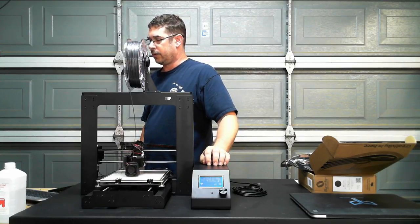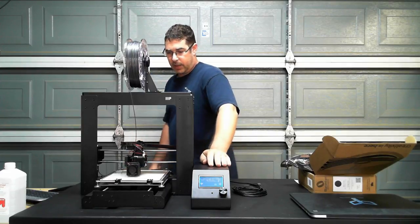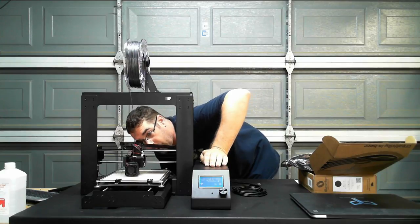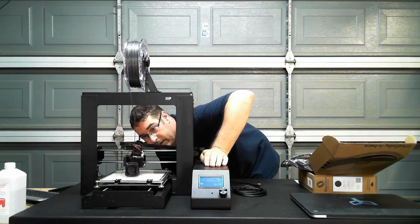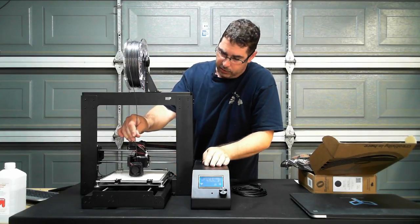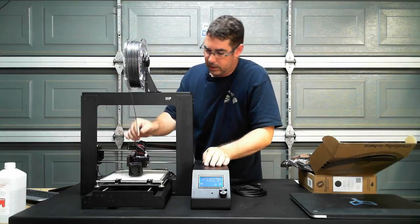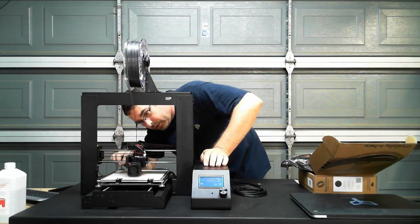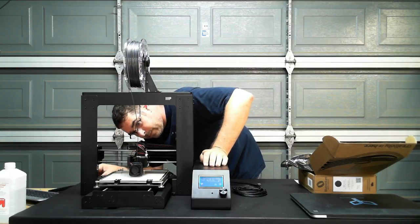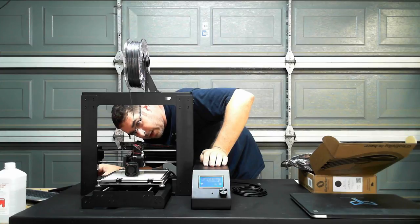But so, yeah, I sliced this at very, very thin layers, which is why I'm not seeing a buildup. So I wanted to give it a chance to get through a couple of layers and make sure that we are extruding correctly and that we're not having any issues. Probably should have sliced it thicker for the first layer. But I do see it finally starting to add some.